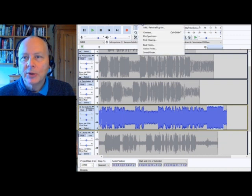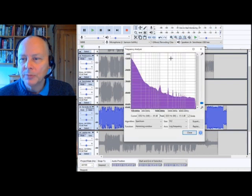Let's use the Audacity tool to plot spectrum, and we're also seeing a spike at roughly 1000 Hertz. That's probably coincidental. We're seeing it at 1000, 2000, 3000, 4000, 5000, and so on. And so we're seeing an interference signal at about 1000 Hertz plus its harmonics.